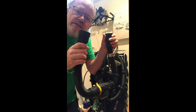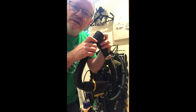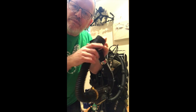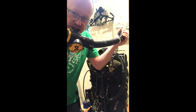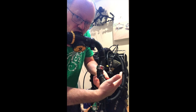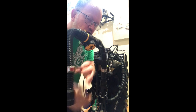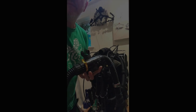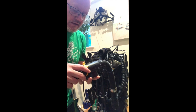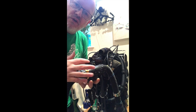Next I check the mouthpiece. This is really important because it has to make sure that gas only comes in from one side and flows out to the other. There are non-return valves in the mouthpiece to stop backflow. That is all good. I also do from the open circuit side a negative test to make sure the diaphragm is holding water out.